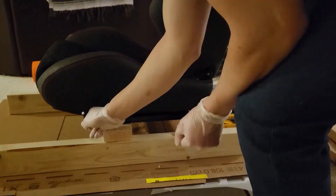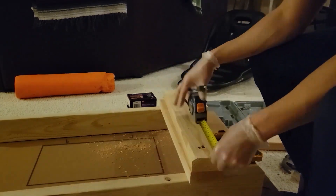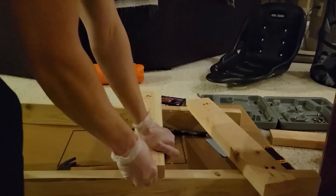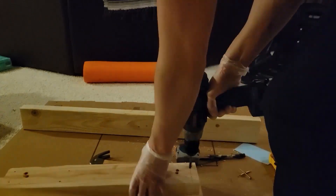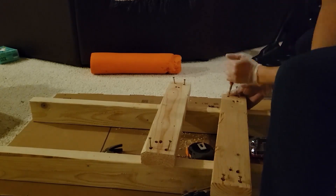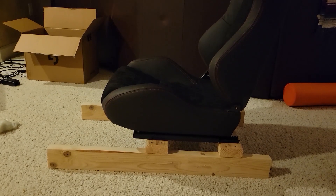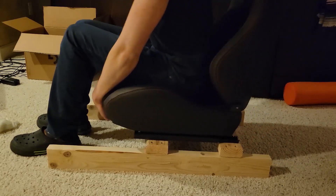Now to begin connecting the planks. To join these, I used standard 2-inch all-purpose screws. I started with a hammer and nail to make a tiny depression in the wood to help center my drill for the first pilot hole, then used a small-diameter drill going all the way through the first plank. It's also important to drill a pilot hole into the plank you'll be screwing into to avoid splintering. Next, I used a larger drill size to go halfway into the top plank, using tape on the bit to ensure I wasn't going too deep. Then I used an even larger drill bit to clear the diameter of the screw head, hiding it inside the wood to lessen the risk of toe injuries and give more thread engagement in the lower piece.